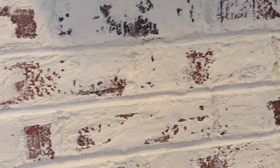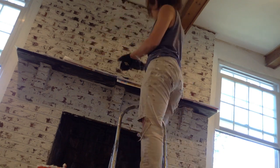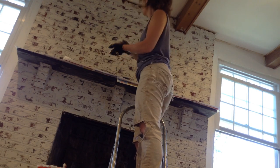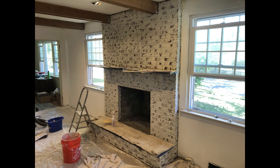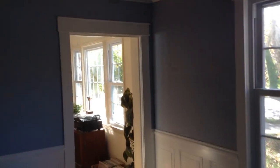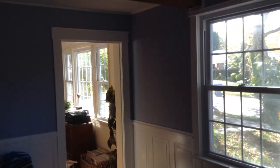This is all personal preference — you can leave it more textured or smooth it out much more. I wanted it to look as intentional and hand-done as possible. Once it was done, there's not much color showing through, which was the goal. I covered especially the darker bricks on top. This material has a couple hours of working time — it doesn't dry, it's actually a chemical reaction and it will cure. I'm probably going to put a clear coat on this even though I did it two months ago, as it takes about 30 days to fully cure. That was the finished fireplace, plus a small snippet of the craftsman moldings and trim I cut and put up. The beams on top meant I had to make very tiny moldings for the tops of the windows. The room also got a wainscoting wall.